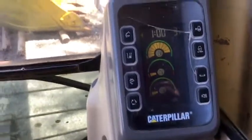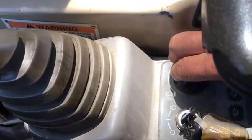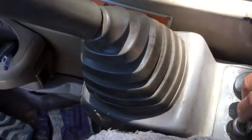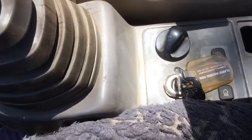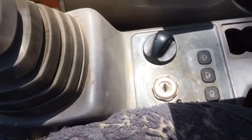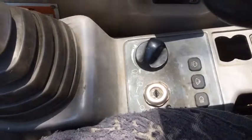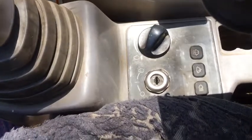When you want to stop the excavator, all you do is drop it down to zero acceleration and turn your key off. Normally on these machines, because it has a turbo, you can let it run — it'll turn itself off. You can take the key out as I have done now and just wait until it turns itself off, then lock the door. That's it, very simple.